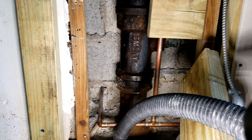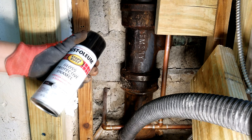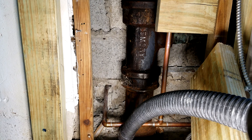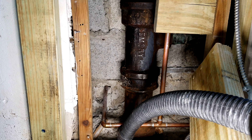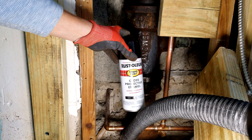So there it is all patched up and now we're just going to wait for it to dry. Then what we want to do is spray our Rust-Oleum paint on here. Before we do that, we're going to spray the whole thing down with another Rust-Oleum product — I'll put a link to it in the description. This Rust-Oleum is a primer that's also a rust inhibitor, so it will coat this entire cast iron stack with a protective coating that will keep any further rust from happening. Then we'll put a top coat of protective enamel on top of that.